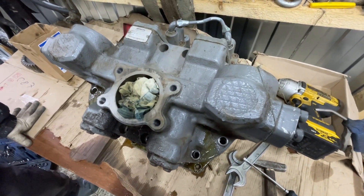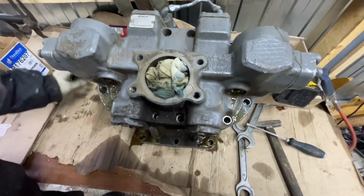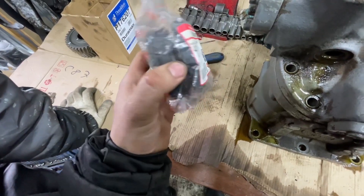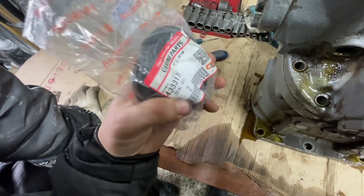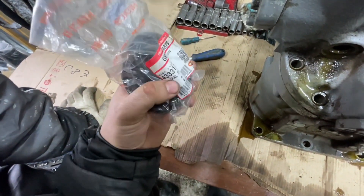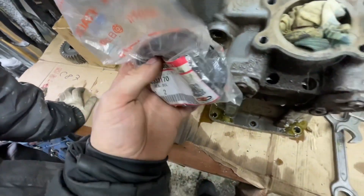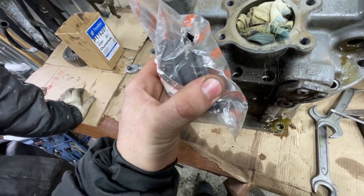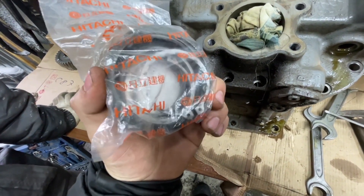What's the reason? These are the oil seals, leaking on the pump. It's always leaking, boosting the oil seals. There's a reason for that: after the customer changed these oil seals himself, I think two times already, it held for some time, and then he came to us. I said it is necessary to dismantle the pump, because most likely the drive bearing has failed.